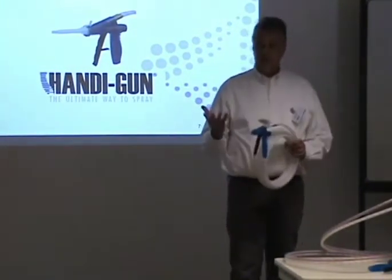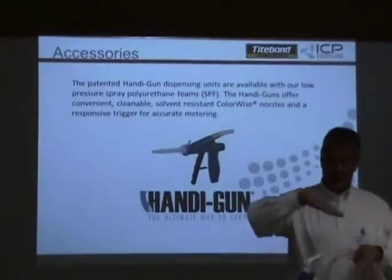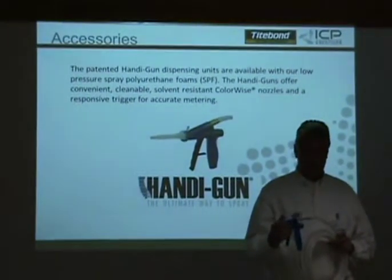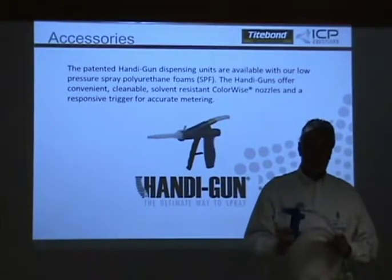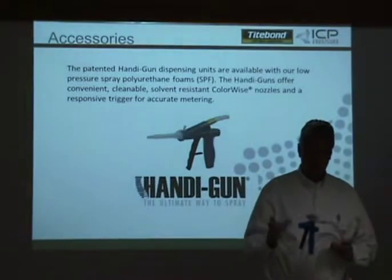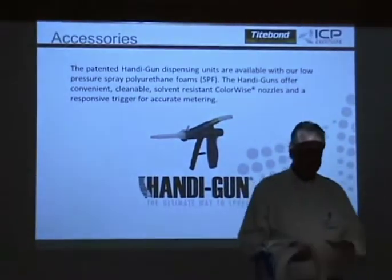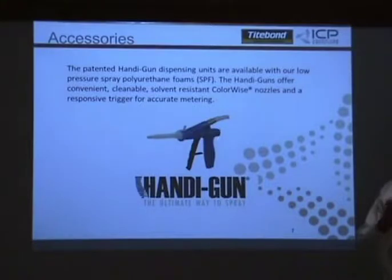One of the things I say with the full trigger, if I'm in an attic doing air sealing, on my stomach, and it's a 3/12 pitch roof and I can't quite get out to that soffit line, with a full trigger and the cone nozzle, I can shoot 4 or 5 feet with no problem. It's not going to look the greatest, but I know it's going to get out there and it's going to be good foam. So full trigger in a situation like that is what we recommend. And also as you're emptying the kit, you're going to start pulling full trigger because it's a finite amount of pressure in these tanks. So at the end, you're going to be pulling full trigger. But this is definitely a differentiator, I guess. That word was used earlier and I didn't respond to that one. Differentiator between the guns.